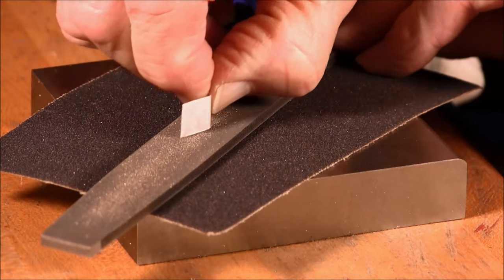Here's our sheet metal right out of the pickle — nice and clean with a really nice sharp solder seam along the entire bottom of the top piece. Let's review the five secrets: number one, clean metal; number two, good fit; number three, flux coverage; four, solder placement; and five, even heat. By keeping these five secrets in mind as you are soldering, you will increase your success chances one hundred percent. If only one of these steps is not done, your success rate will be zero percent. Please leave a comment with any questions or topics you'd find helpful, don't forget to subscribe, and thanks for watching — see you next time.